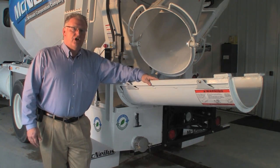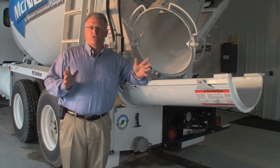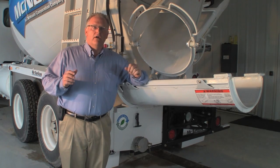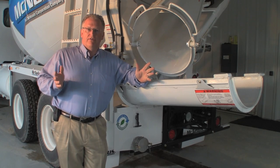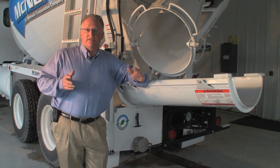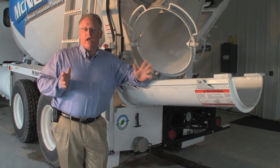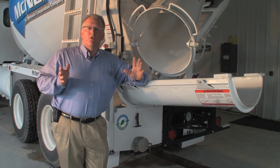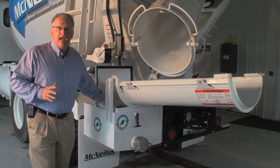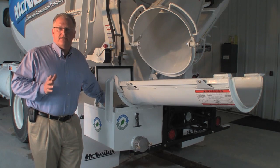This is actually the truck that will be in the show. This solves an environmental problem that Ready Mix producers are increasingly dealing with, with regards to the chute wash water. Chute wash water has a pH of 9 to 12, which has been causative for environmental concern. In many places, states and municipalities are not allowing you to wash down onto the ground anymore. So what we're doing now is capturing the chute wash water in this vessel and then returning to the plant and discharging it into your pond system.